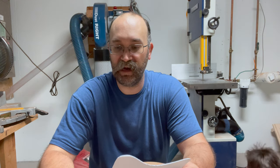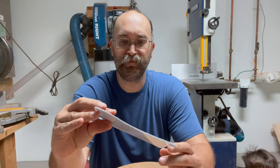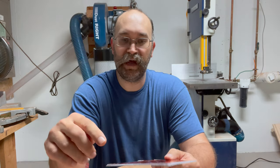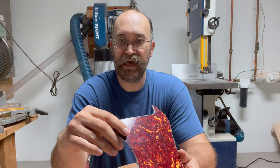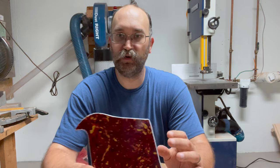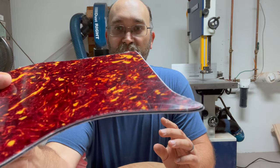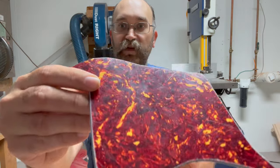I thought that was the end of the video, but I kept on working on the pickguard and I think I've got an interim solution. The first thing I did was go to my belt sander and spindle sander and grind down some of the comically large bevel, which got me back to a 90-degree edge. Then I tried to sand using the table — the table on my spindle sander actually rotates down — I tried that, it didn't quite work, but I was on the right track.